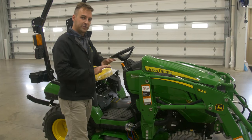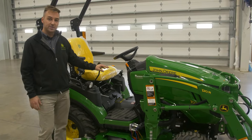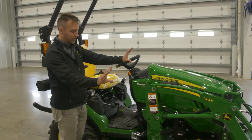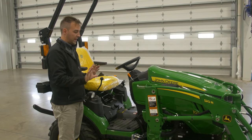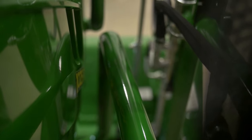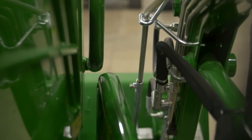Once you do both of those levers, you're disconnected from the tractor mechanically. Then all you do with your joystick is operate your bucket and press that forward, and your tractor will automatically move out from under your loader as it goes forward. Up front there's a post that drops down and acts as kind of a tripod for your loader so that it'll stand up on its own.